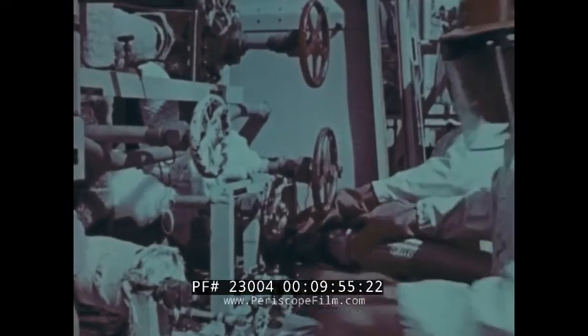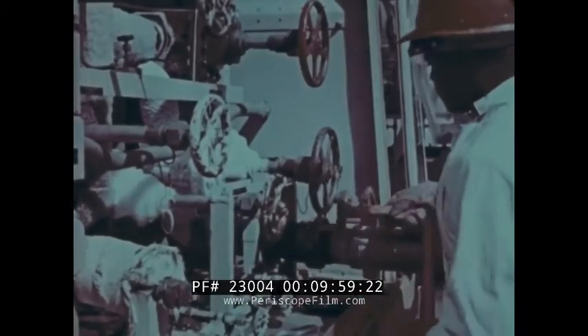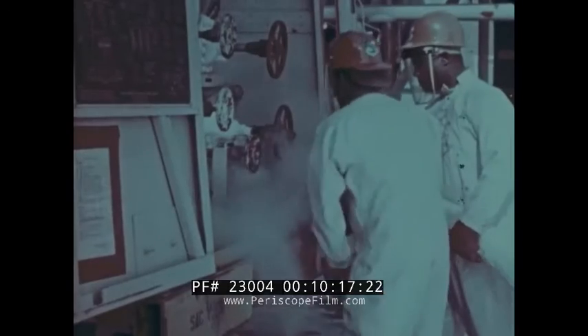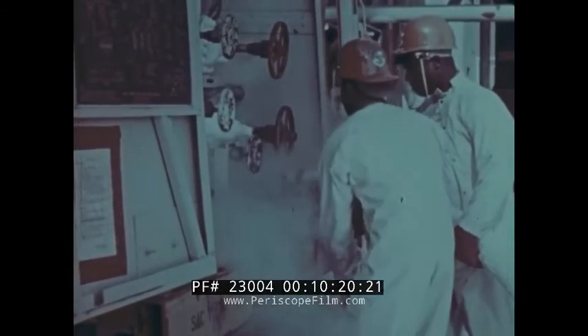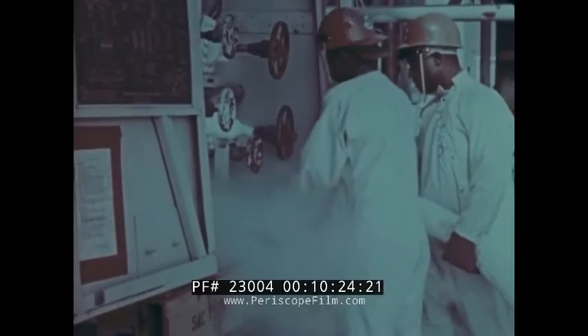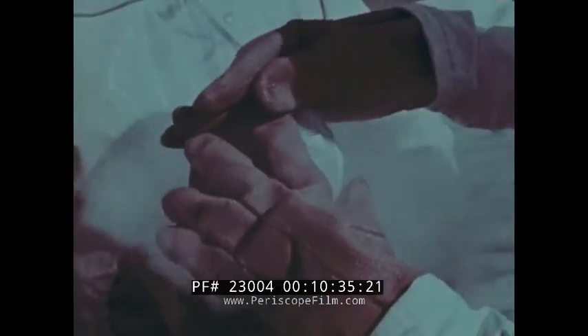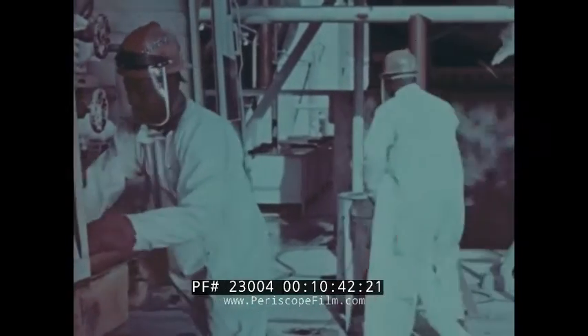Remember, use non-sparking tools only. Keep in mind that after the LOX flow has started, if this equipment touches your unprotected skin, instant and severe frostbite will result. When the transporter has been filled with LOX, the transfer operation is completed by disconnecting, and the grounding lead is disconnected.